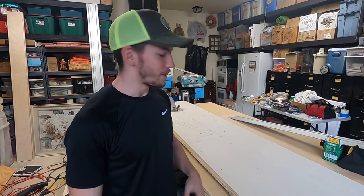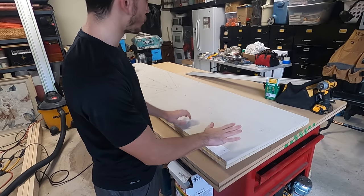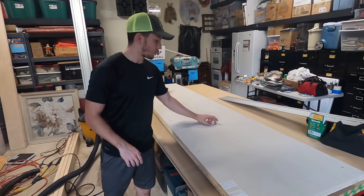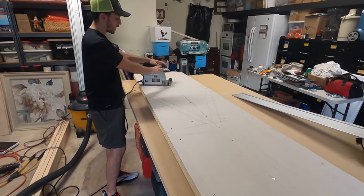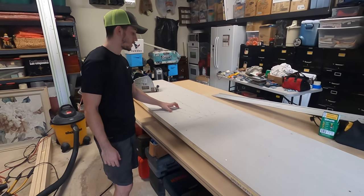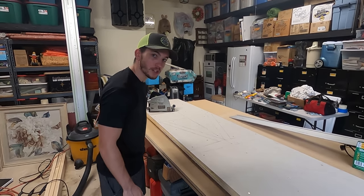It is the next day here at the house. We have our two plywood boards — they're laminated and glued, super strong. All that's left to do is remove all the screws that we put in yesterday. After we remove them, we're going to use our Festool track saw with the 55-inch Festool guide and cut these as accurately as we can — pretty much what a CNC would be doing, but we don't need a CNC because we have a track saw.